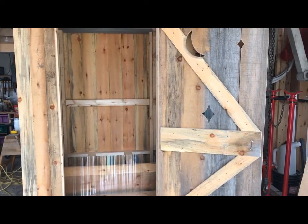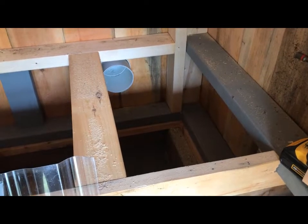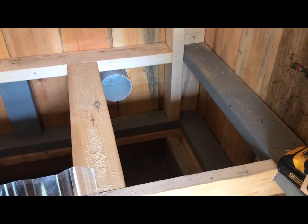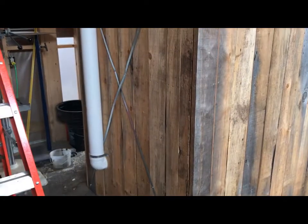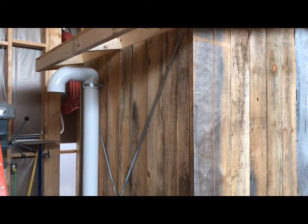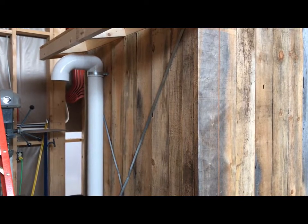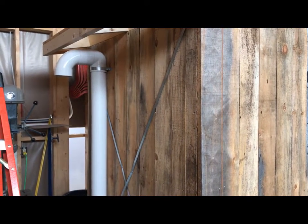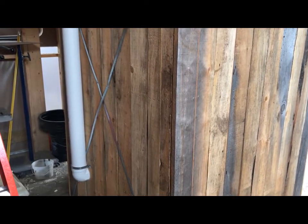Make sure that the door is braced very well. If you're using sheet product like plywood that won't affect you. I used a PVC sewer pipe — white PVC four inch — to do my vent, so it's vented to the inside of the lower container. That's where it comes out on the back and I just turned it down onto the eaves. I should have turned it so that it was parallel to the wall of the building so it would have been tucked in under the eave nicely. I'll put screens on both ends to prevent animals and bugs from getting in and making nests.